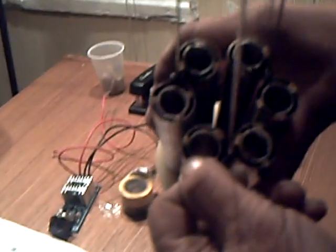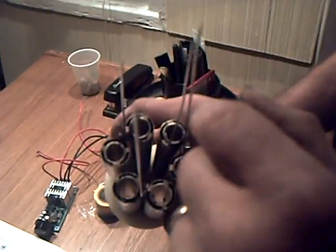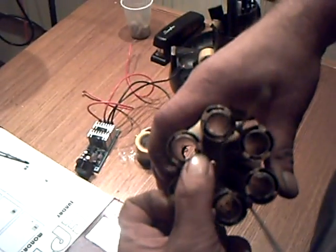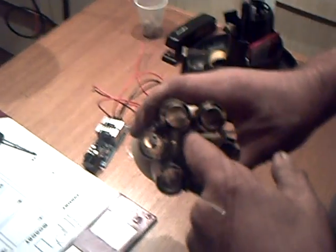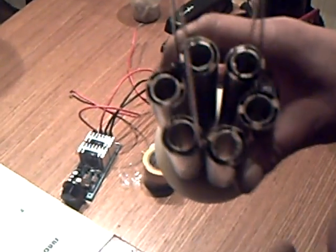We got a lot of production between these tubes — that's where your hydrogen is produced. What I was thinking about doing is taking my fly cutter, going down the middle here with a one inch fly cutter, putting a tube that goes all the way down, and then TIG welding that with a bridge to the negative. That way we're going to have production in between each of the tubes and also in between the outside tubes — so we're going to have a tube in the center. That's what I'm hoping for anyway.